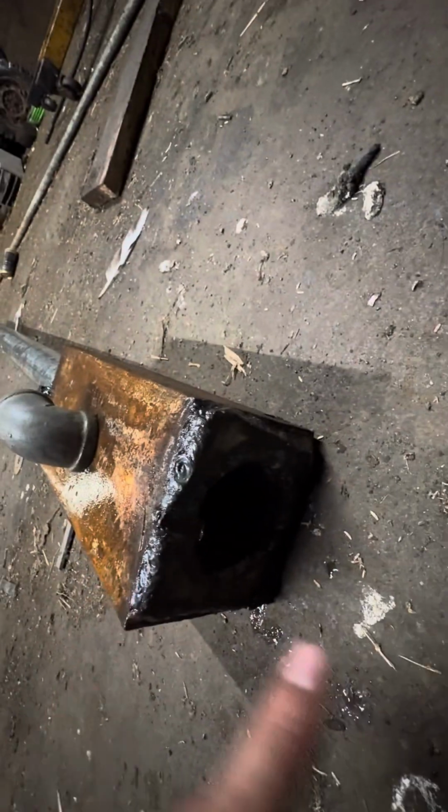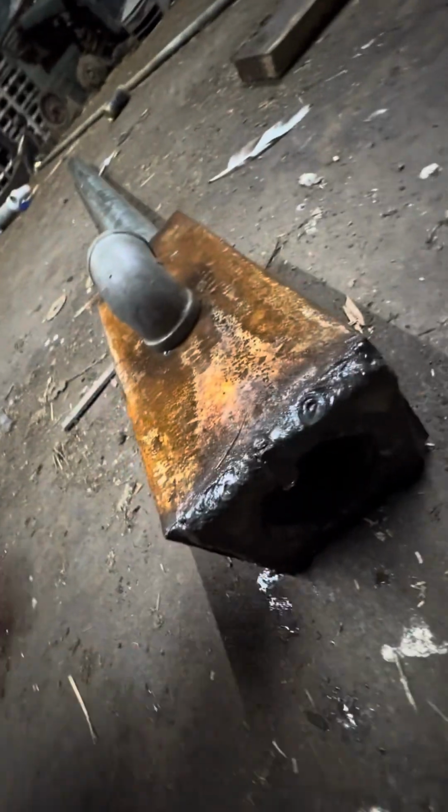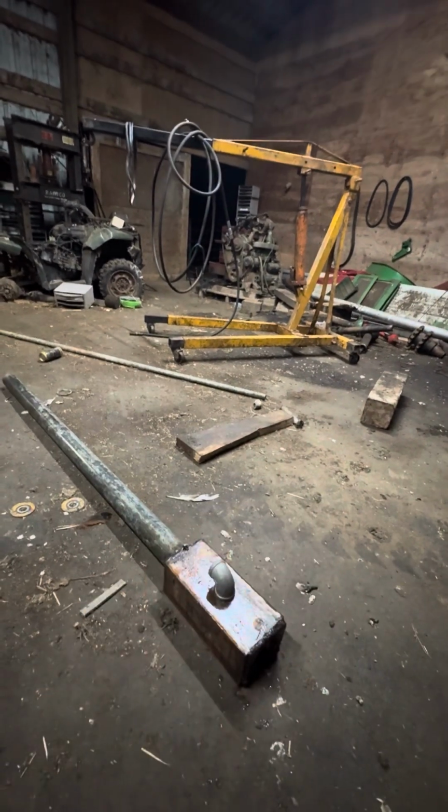And also, I welded the caps on the top, on the front, on the back, and these 2 little pieces of bar here I need to grind off because they were simply used to hold this pipe in the middle of this square tubing. And there's the breech, and there's a bunch of slits up along the sides. You can see here, there's one of the slits that's going to allow the air, when it rushes in, to go up into the holes inside of the shell, which will propel the projectile out the barrel.